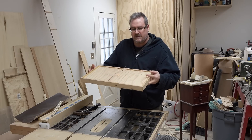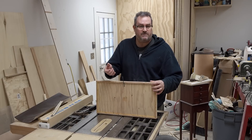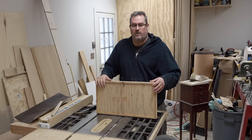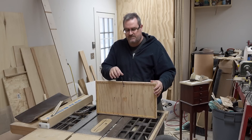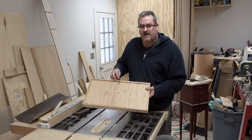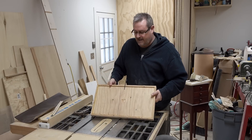It also doesn't have a switch. I originally made it so it would just plug into the battery on the back of the gantry. I've got a connector that just plugs in, and on the surface that seems convenient, but it's a hassle because you've got to hunt for the cord — it's hanging down or tangled up. Better to just plug it in and have a switch to turn it on and off. Also, something has come loose on the inside, so sometimes the light will flick off right in the middle of a shot, and that's not a good thing.